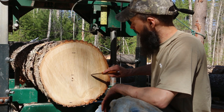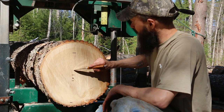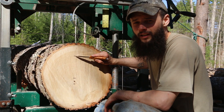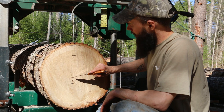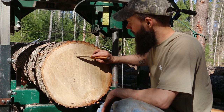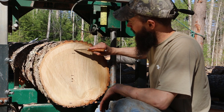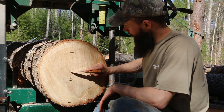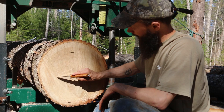This nice big section of clear timber here is five and a half inches thick, and we're going to use that for part of the deadwood or part of the keel. The keel timber needs to be ten inches thick, and we're going to make that up out of two five-inch thick beams bolted together. I made it a little bit fat so that if this shrinks a little bit, there's still some wiggle room. We can plane some off of both sides to get it nice and square, and still have our full five-inch thickness. This top part is a little thin, but there's still some heartwood here. We'll get an okay board out of here - it won't be great. But to the right and the left, it will be really nice quarter-sawn lumber.